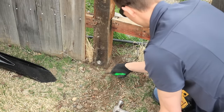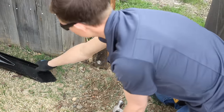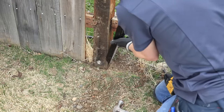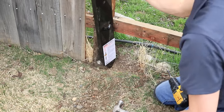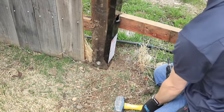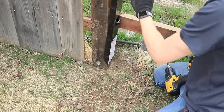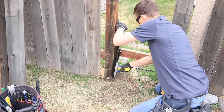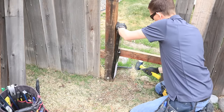I'll take something to scrape in there and find the hole in the concrete where the post sits. Now you can see that. What we're going to do is install this easy mender right there — we're basically going to hammer it in. The trick is to get the easy mender wedged in between the concrete and the fence post. Make sure it's centered as it's going in, and you can tap it on the side if it's not centered perfectly. Then just go ahead and start pounding it in.